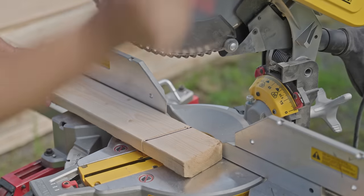Yeah, now I don't know about you, but I'm loving that. Now the purpose of the line is not where I'm cutting. Remember, I've only got to go about 6.5 feet maybe, okay? So the purpose of this line is to establish the cut line. Now we know we're cutting 18 degrees all day long. I'm even gonna write that over here because that's my cut.